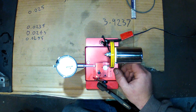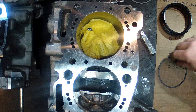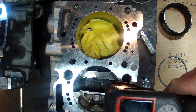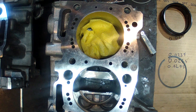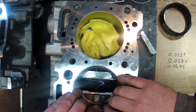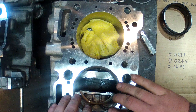Power switch on the side and that's how it works. Okay, it's now later in the day, it's warmed up a bit and I'm ready to do my final measurements and cutting of the rings. The temperature of the block is currently 21 degrees, the feeler gauge 20 degrees, and ambient air temperature is 20 degrees — so it's about right now to check the final clearances for these ring end gaps. Doing the second ring first, I've already got it close this morning when it was colder but leaving the final cut until now.